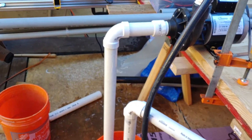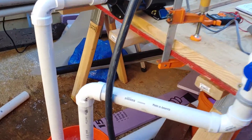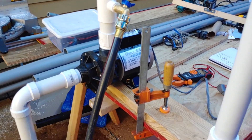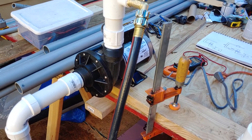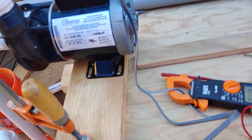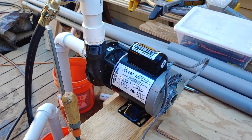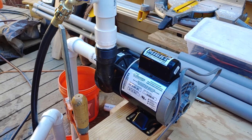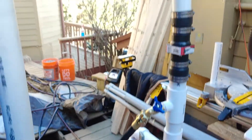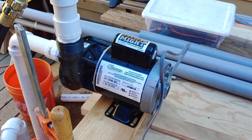This is approximately two and a half feet of gravity head. So while it might not be the advised way to run this pump, it definitely works. My guess is that the company that makes this pump supplies it to builders who aren't going to engineer a priming circuit, which is why they say that — sort of covering themselves in the manual.